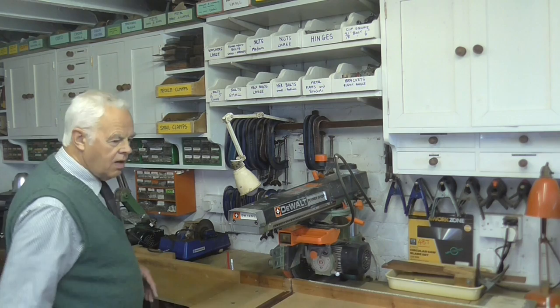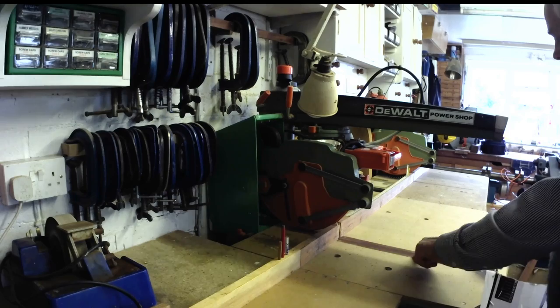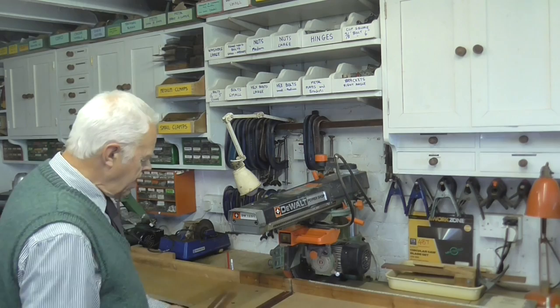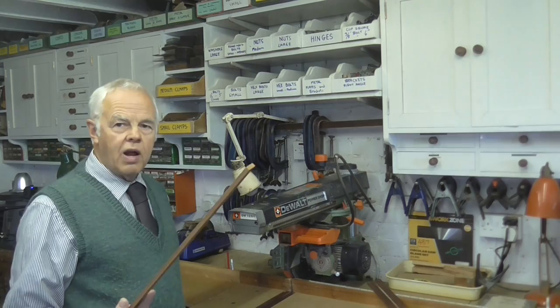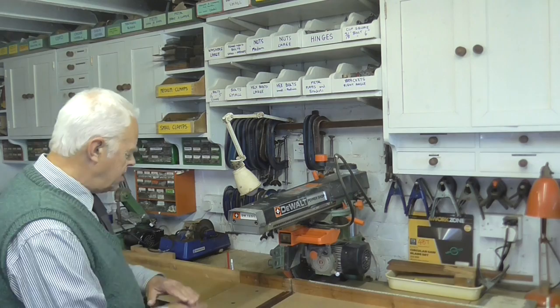I'll just point out this little inset piece on the bench here. What I've done is routed out a section of the top, then used a piece of old mahogany and inserted it in there — it's held by six screws. When it's worn out I can just change it; I always make two or three spare ones. There's one here I've done already for next time. It gives the timber some support underneath.